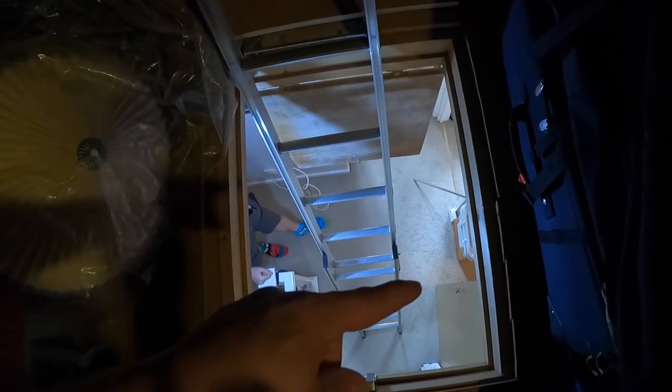I'm in the loft. We were setting up the perfect scenario — we connected the spurs in there, wanted perfect readings, going to show you the perfect way to do it. We couldn't get it — we had 0.2 megaohms. So that's a fail, live to neutral.